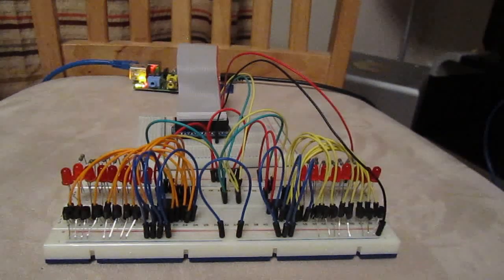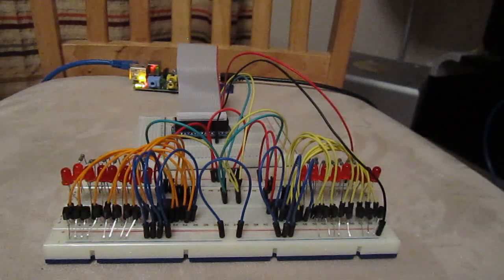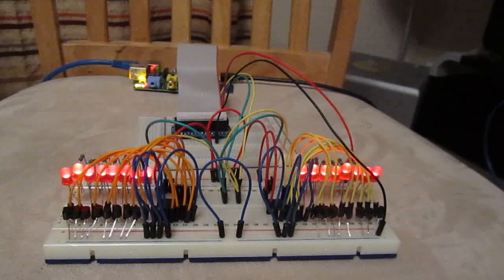Okay, so what we can do is I can select the chip with the address of 56 and open all the ports. There we go, everything lights up. I could close them, so close all, and they close. I could write them again. I could go to the 57 address, so it's just changing one little parameter of 57, and then write all, and they'll come on. Okay.